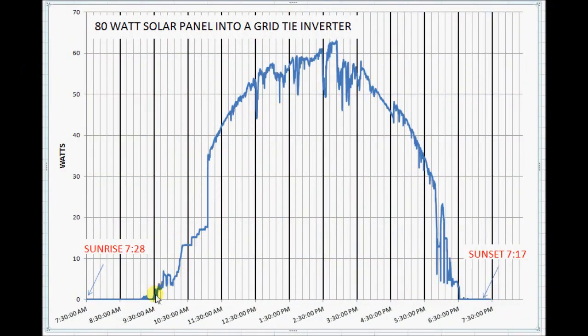So in the early part of the video you saw the shading time-lapse that I took for today. And now here is the data run that I got from my watts-up meter, sampling one sample of power in watts every two seconds and collecting that through the course of the day. Sunrise was 7:28, sunset 7:17. So you can see I didn't get any kind of power coming out of my panels on the front of the house for two hours today. And then you can see how much each hour it increased. It took an additional two more hours to get up to anywhere close to peak power. Now each one of these gradients here is one hour — the Earth rotates at 15 degrees per hour, so each one of these is 15 degrees of movement of the sun across the sky.